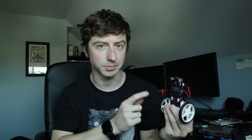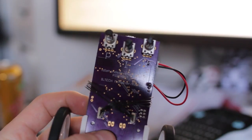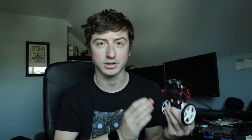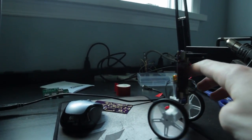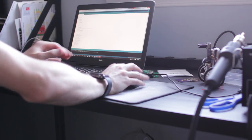The PityBot was designed as a teaching tool for the PID control algorithm. There are three potentiometers for the proportional, integral, and derivative terms of the control loop. Even if you don't fully understand what the PID loop is, you can begin to understand what the terms do in terms of control for balancing. You can also design your own programs to run on it because there are encoders underneath, which lets you make things more complicated.